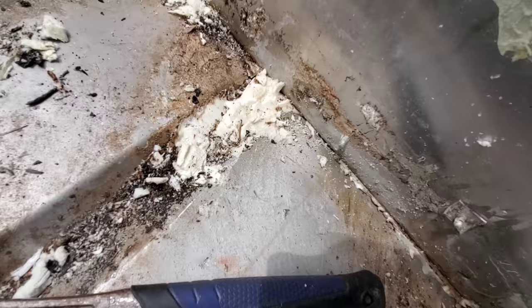Got the parts all sanded and cleaned up. Time for some carpet. Speaking of which, we are running nothing special. Home Depot outdoor carpet. I got a roll of it. It's about 30 bucks worth of carpet to do this in the floor system. And guys, this is a budget project, so we got budget carpet for this project. Indoor outdoor carpet adhesive. This brand in particular is purchased at Lowe's. I got some spreaders for spreading the glue. Our staples are quarter inch stainless steel so they don't rust out. Staple gun, plugs in the air hose and compressor, some pliers to pull the carpet tight around the edges and staple it down.